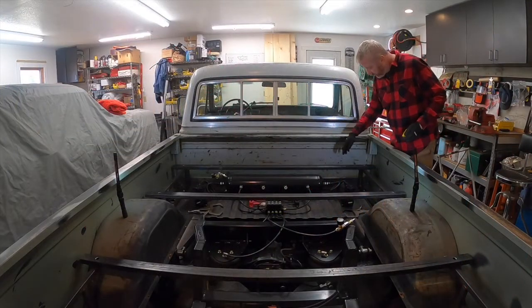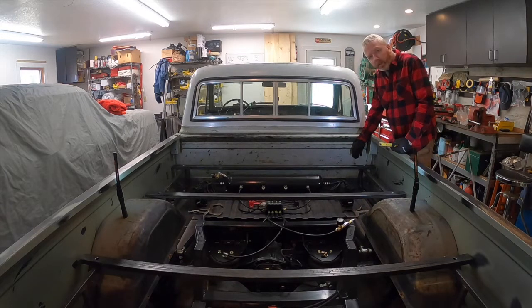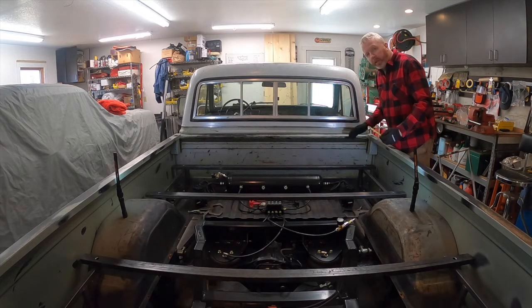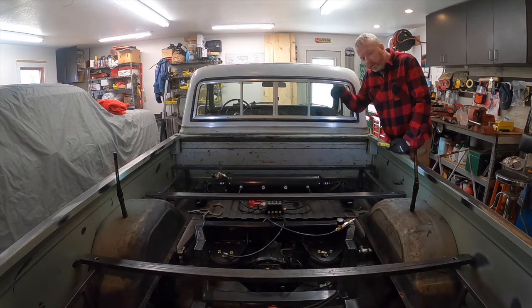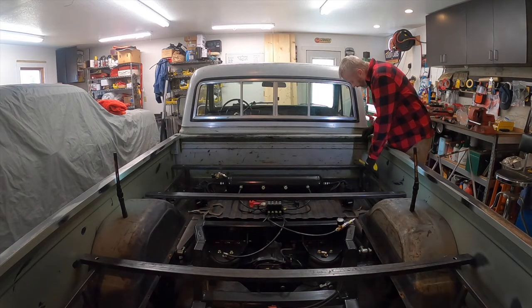To finish drilling the holes on these cross members, I'm going to measure off this bolt kit and preset this first one, get it drilled and bolted down, and then measure back each one, drill and bolt it down so they're nice and parallel with each other as they go back. That'll make it easier for my straps for holding the wood down. I can mark one of the straps, stack them and drill through all of them, or drill one and use it as a guide for the rest.